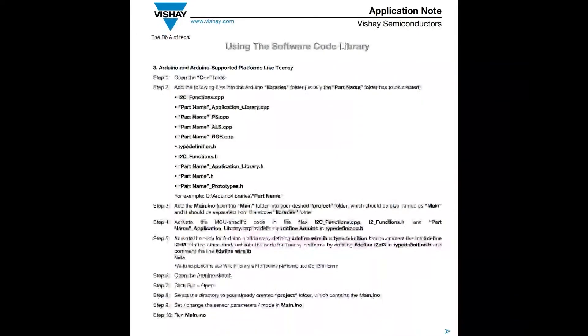There's code available — you can configure it over STM32 or, in this case, Arduino. They tell you how to extract the library. It's not in the Arduino Library Manager, but the code is there — you just have to unzip it and put it into your Arduino folder. You can get started that way if you aren't interested in writing your own driver quite yet.